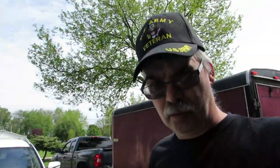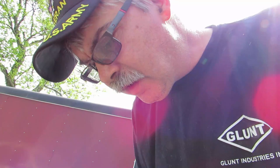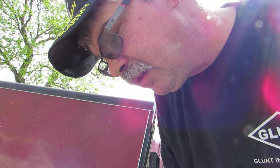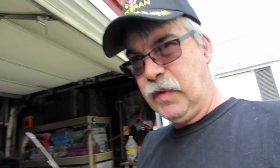Success. Now I'll get my tape measure out — my calipers or something to measure the ID of the tubing and see what we end up with. I got my little trusty caliper here. It's a generic one; I have better digital ones at work, a good set of inside mics and calipers. I'm going to get a measurement here. Looks like it's somewhere between one and nine-sixteenths and one and five-eighths — I'll call it 19 thirty-seconds, so it's going to be like .5937.